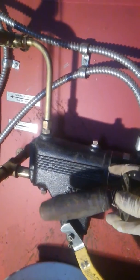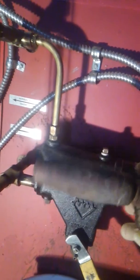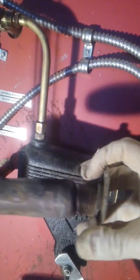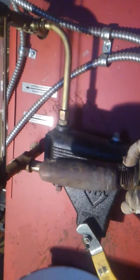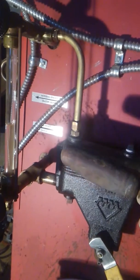This is the low water cutoff and this is your float switch — it pretty much looks like some weird shape here. When the water goes down, the float switch naturally drops. It has a spring, so when the water gets back to the normal water line, the float switch rises, which gives power to the burner and the burner starts.